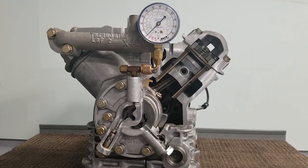Our oil pressure should be somewhere between 15 PSIG and 45 PSIG. We do have a pressure release set at 45 that's inside the housing. If the pressure would drop below 15 PSIG, that's a good indication that we must have some bearing wear or some more parts within the housing.